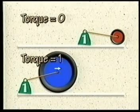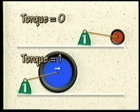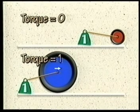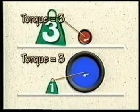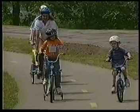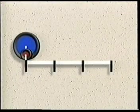The small wheel can pull the weight because the force exerted by its rim on the ground is enough to overcome the drag. But with the same torque applied to the larger wheel, because of its three times greater size, it has only one-third the force at its rim and cannot pull the weight. The large wheel needs three times the torque to pull the same weight. A good example is bicycles — the one with smaller wheels will be able to climb hills or tow a load with less effort than the one with larger wheels.